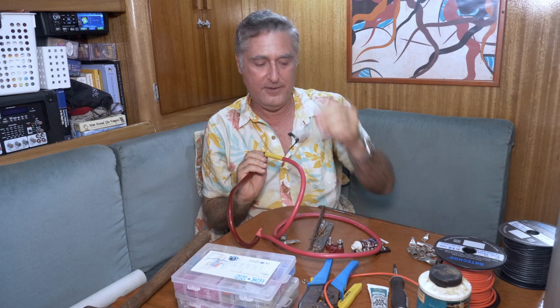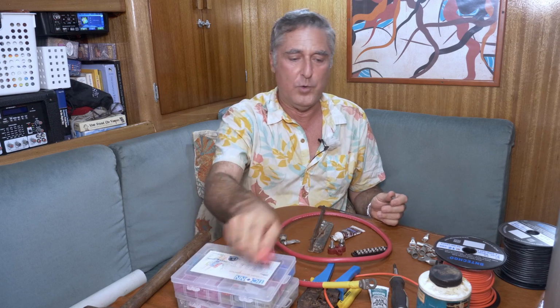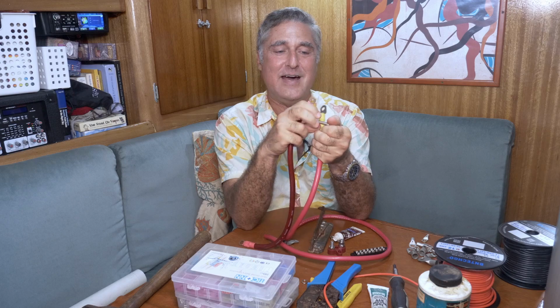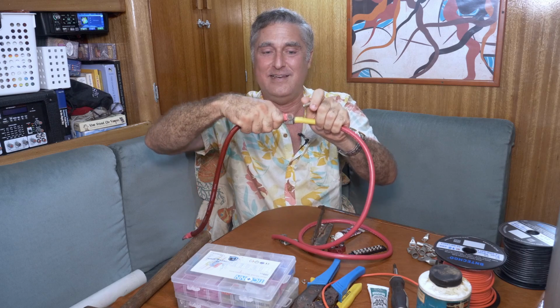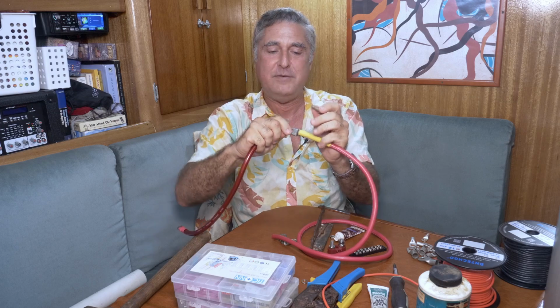So if you're using a mechanical fastener, use the mechanical fastener. Sometimes a terminal block just doesn't work out. There's no room for it. Well, it's perfectly reasonable to use a regular mechanical fastener that's not connected to anything. You have to realize that this possibly charged copper is going to have to be protected in some way, either retained to a wall or wrapped in something.